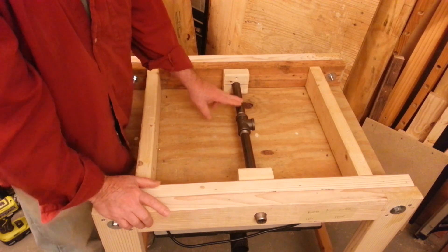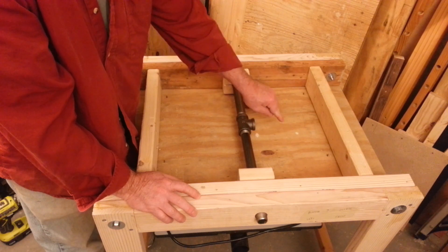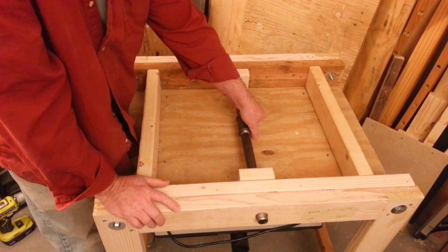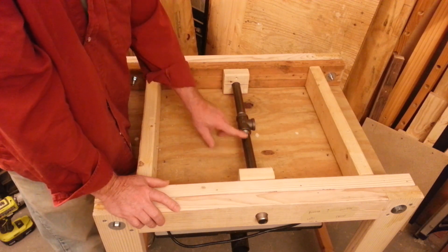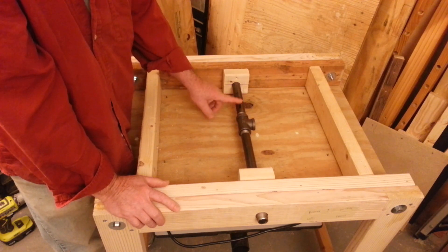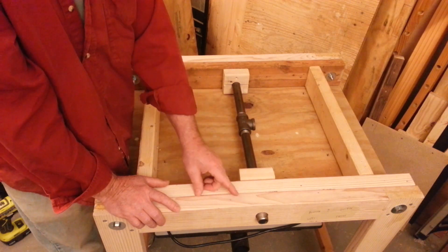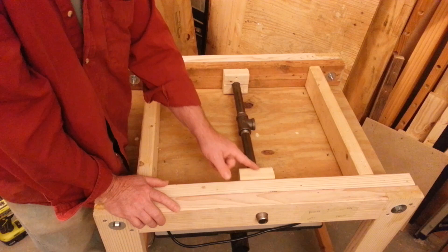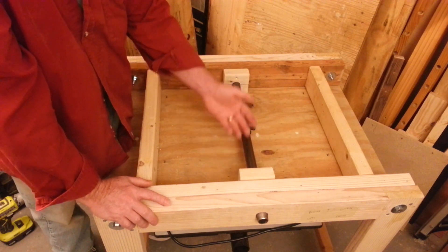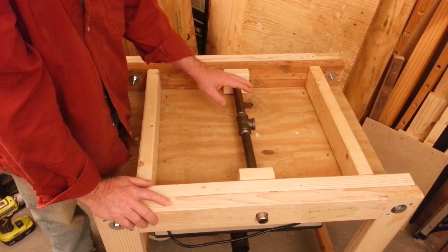So I'm already changing the change. The reason I wouldn't run wiring through the metal pipe is that the inside is fairly rough, particularly around where the wire exits the T-fitting. Since there's voltage on that wire, the roughness of the metal on the inside of the T could damage the wire and electrify the pipe. I've thought better about running a power cable through a metal pipe. On the other hand, I'd consider using a plastic pipe if it were stiff enough — since plastic doesn't conduct electricity, I'd feel much more comfortable running a power cord through it. So the evolution went: wooden dowel → black iron pipe → now reconsidering a plastic pipe.